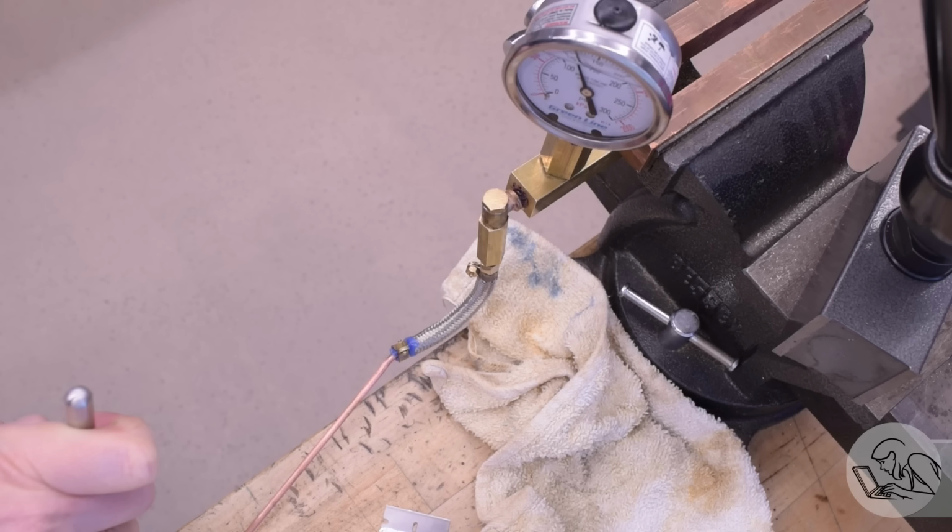All right, what is the next weak spot then? With that hose clamp fitting fixed, I go back up to 100 PSI, and a little bit past that, around 125 PSI, the plug at the top of the valve body gives out. So I tried tightening that down, pumping it up again, but that did not fix it. It still leaks around 125 PSI.